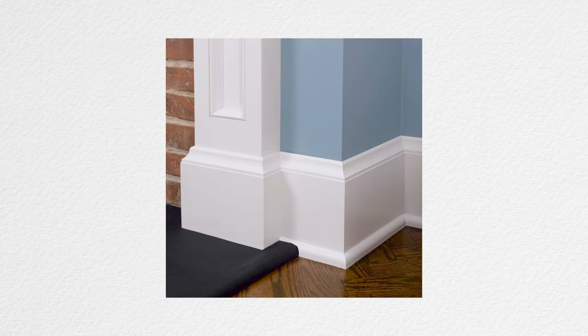If you're doing door casings and baseboards, put in your door casings first, then the baseboards, because generally your door casing should go across the top of the door all the way down to the floor, and then your baseboards can build off of that. Always check historical references though — if you're in a time-period home and you want to maintain the integrity of the home when renovating, just double check everything before you make your final decisions.